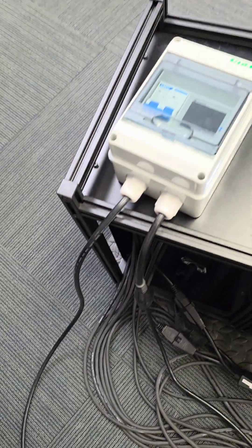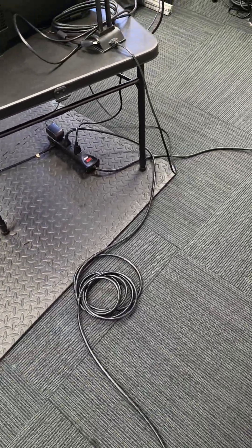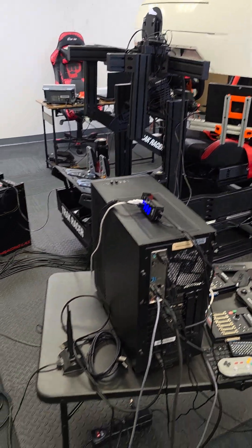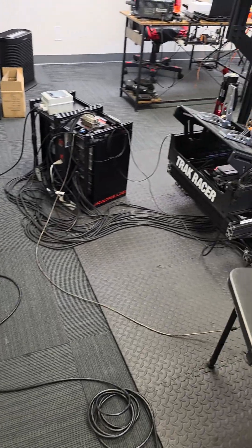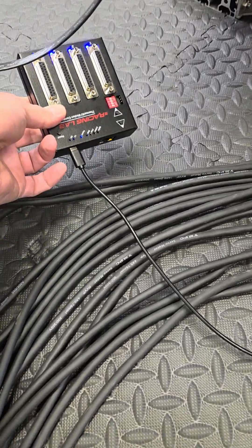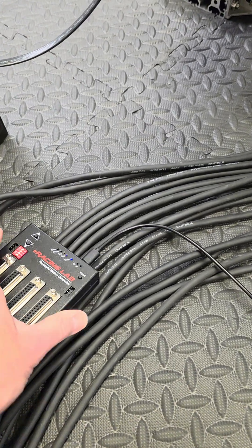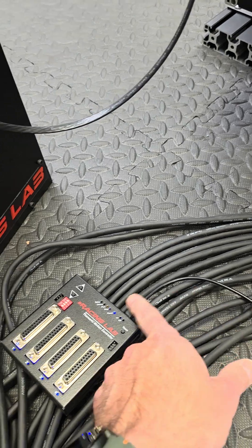Make sure the power for all that is kept as far away as possible, so it won't interfere — possibly causing EMI. If you have space, I recommend just leaving the wiring a little loose. If you have to run cables the same way, make sure you don't put cables parallel — cross them instead. If you put them in parallel, there's a possibility they'll induce some noise into the low-power cables.